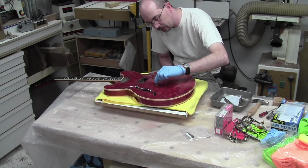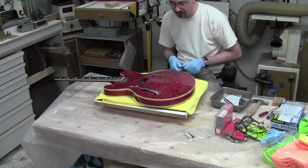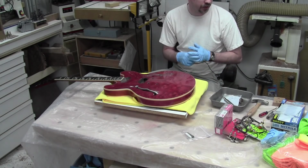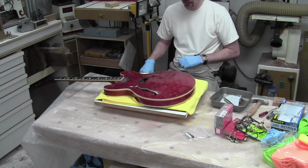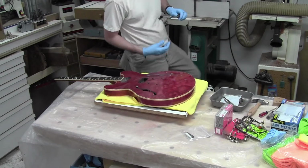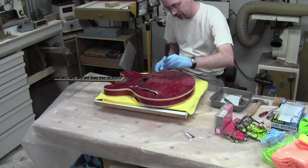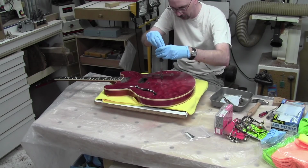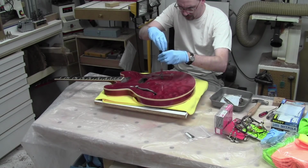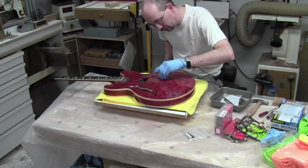Ha ha ha. Gabriel, you were right. The lacquer has somewhat slightly closed up the holes a little bit. So what I need to do, I'm going to do this very low impact. I'm going to go get a small countersink. Alright, this is like a 6-point countersink. I'm not going to go in the cutting direction, I'm going to turn it counterclockwise, just to sort of back burnish and not destroy lacquer while I do it. And then that'll do. Now this should just go, yep, it'll go in now.